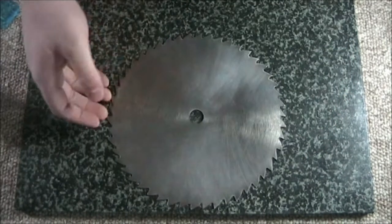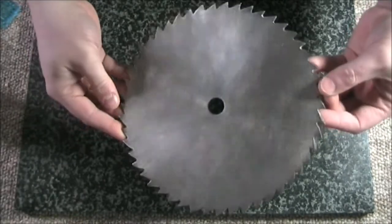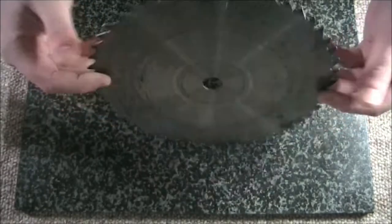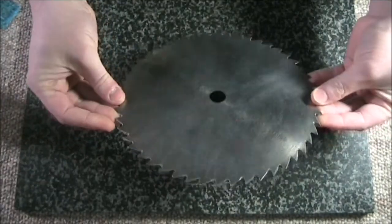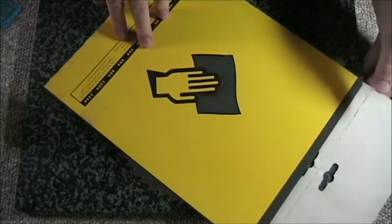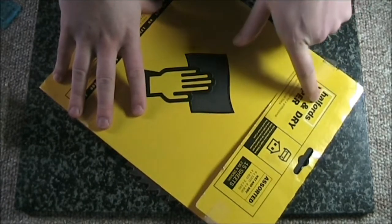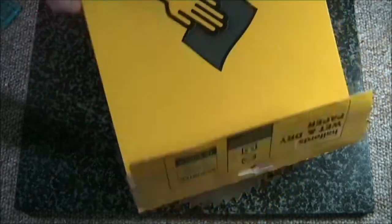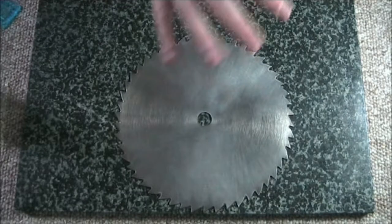What you need to do is clean it up with the sandpaper, using rougher grits and working your way up to a finer grit. This was done by hand and it's given it a nice brushed steel effect — a little bit rough but that kind of goes with it. I've left the backside rough to show you what it looked like originally, and as you can see it's cleaned up quite well just by hand. You can get the sandpapers from body repair shops, DIY shops, pretty much anywhere.